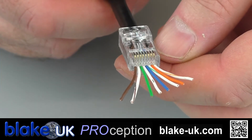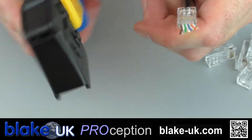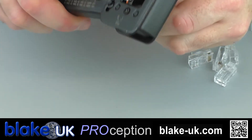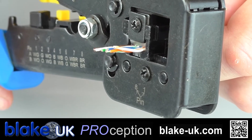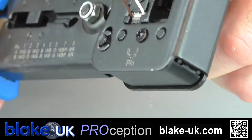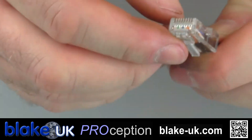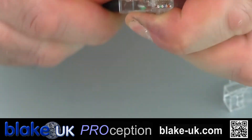Once you've done that, you can then safely put the wires back together. Get a hold of your tool and push the plug into the recess on the tool like so, nice and snug inside there. Crimp down — this is going to crimp the plug and cut the cable at the same time. Give it a good crimp down. That's cut all the excess pieces off and also crimped the teeth down to cut into the actual cable as well. So that plug is now on.